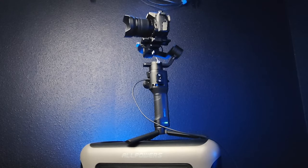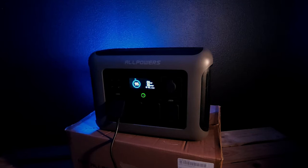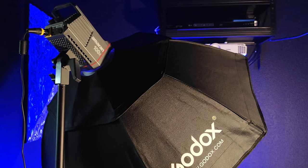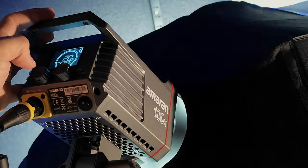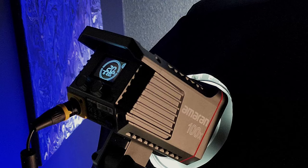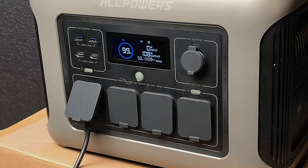This battery will also be ideal for videographers — for recharging a drone or other video equipment. We can see on the screen 28 watts, which is the consumption of the remote control and batteries being charged. I also plugged in a 220V studio lamp from Amaran. At 20% brightness the battery shows 25 watts consumption with a full day of autonomy. At 100% brightness, consumption rises to 108 watts with 9 hours of battery life, and you can hear the cooling fan starting up.